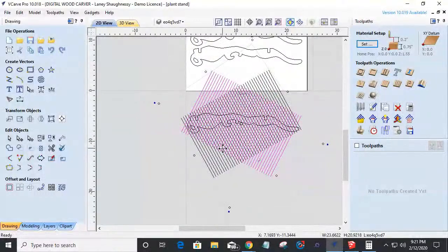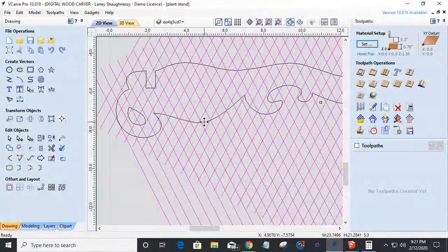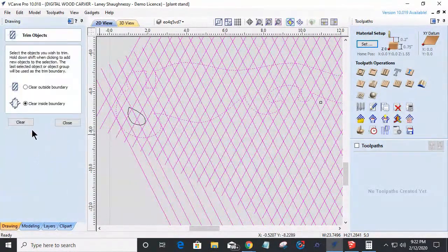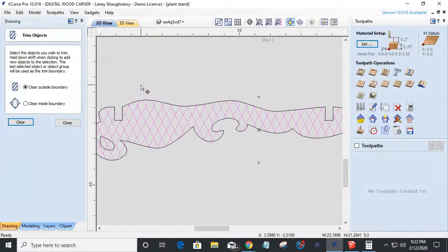If I take those two objects and group them together as one, and I come in here and select my other object, my outline right here, and I selected it last, I could trim, clear, the last object is the boundary, and that's that profile. I could trim by clearing outside of that boundary to create this little crosshatch pattern